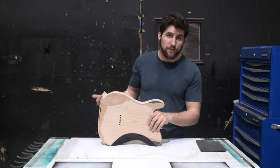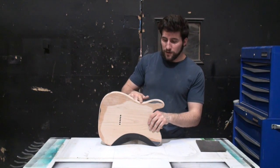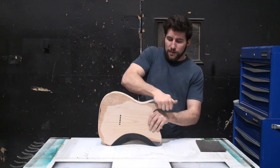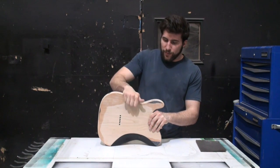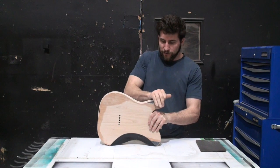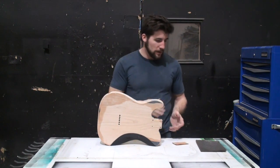So I'm going to smooth this all out using this method because I used a belt sander with a very fine belt, I believe a 220 grit belt, but still it's a belt sander, so it's not going to be perfect. And also about the same on the spindle sander. So now I've got 220 grit paper and I'm just going through and smoothing this edge, and I've got to go back over my routered edge because I've got a little bit of tear away there.